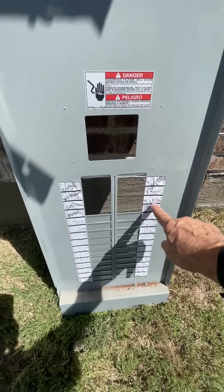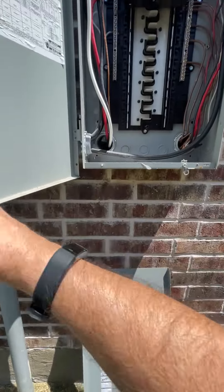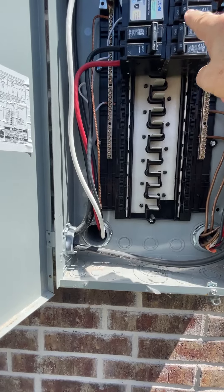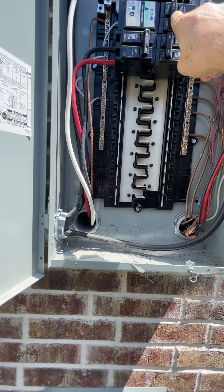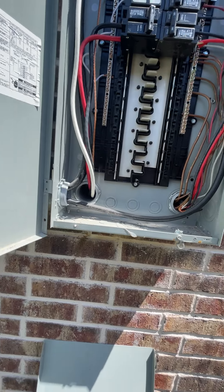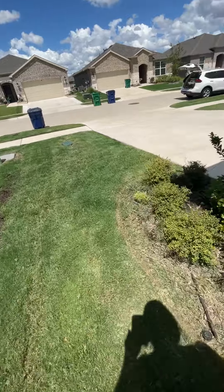This is the AC circuit breaker. It's properly sized — 30 amps for the clothes dryer, 30 amps. The difference is the clothes dryer is supposed to be GFCI protected, and it's not. So we move along inside.